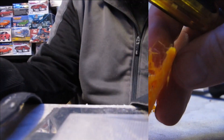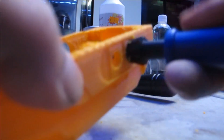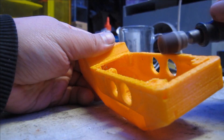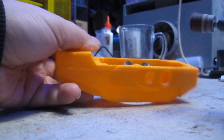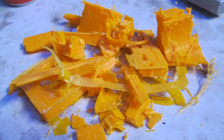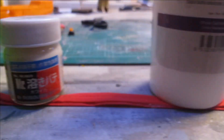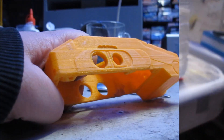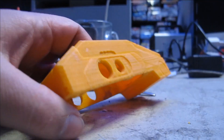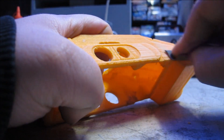The print process runs very slow at about 20 to 30%, which may drag prints out for many hours to days, but this does not push for layer shift, belt stretching, or distortion of the parts. I let it go and don't touch the bed or mess with the printer for as long as I can. If I do turn it on or off, I allow maximum time for the bed to heat up before movement, in case it contracts or expands — this leads to minimal faults.